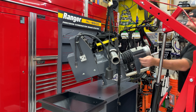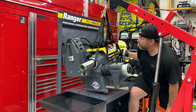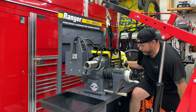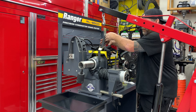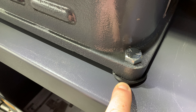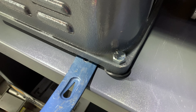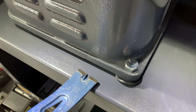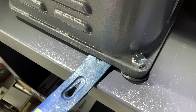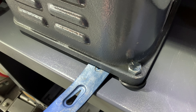All right, with that correct voltage set, let's lower this down. Now that it's on the ground, we want to put the rubber washers in that it came with, set it down, then slide the studs through and bolt it down. I used a little pry bar — it slides around easy on the bench but it is heavy as heck — so once you get it where you want, use a little pry bar, pick it up, slide the little rubber washer in place, stick the bolt through, and tighten it up. Then your lathe will be bolted down.